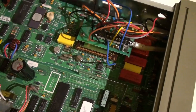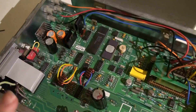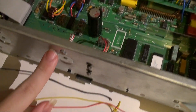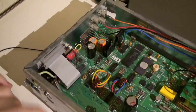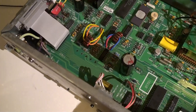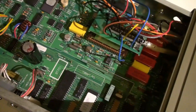I've been recording for about 17 minutes — time flies. So the plan is to fix the transformer: two threaded rods inside here going all the way across, drill some holes, use nuts to keep the rods in place, then zip tie the transformer to the rods. Before soldering all these wires into place — that's gonna be fun. It's gonna be hacky as hell, but I'm probably going to have one of the few HP multimeters with a toroidal core transformer.